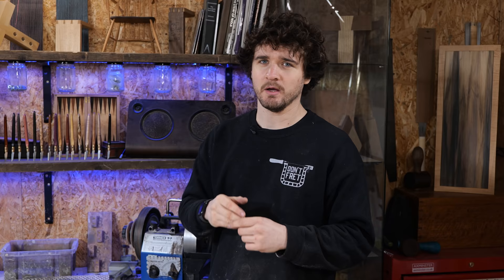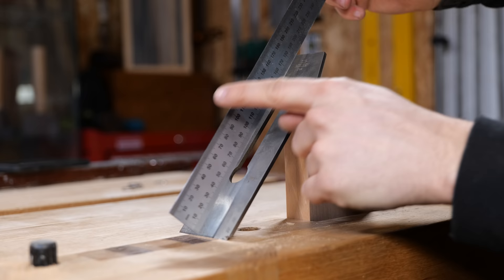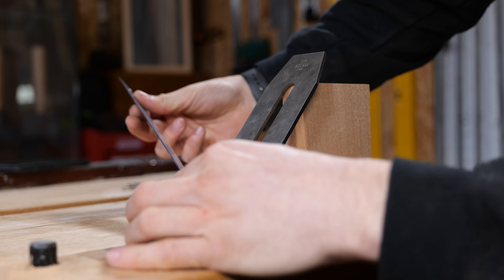Think of it this way: you've got a mountain with a 45-degree slope to the summit. You could walk directly up, but what most mountain path creators do is a zigzag path rather than going straight up. By traversing across the slope instead of going directly up, you lower the incline. All it takes is a ruler on the blade to confirm this — at the moment the blade travels up at 45 degrees, but spin it around and look how low that angle is while still sitting perfectly flat on the blade.